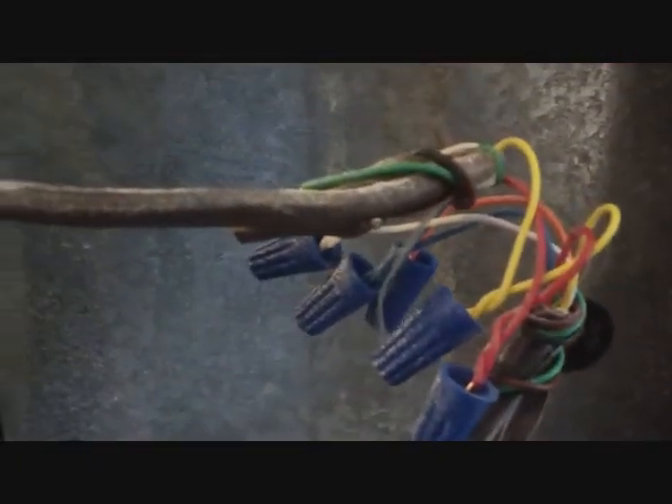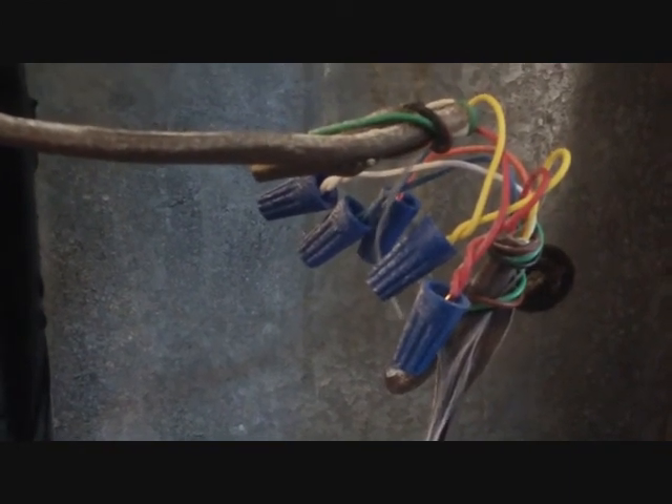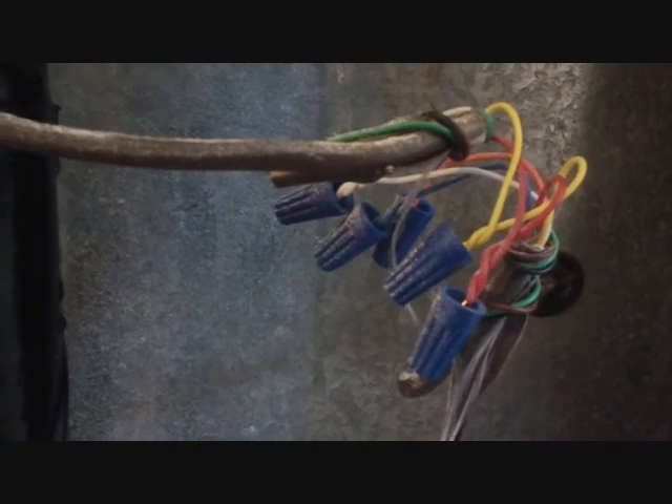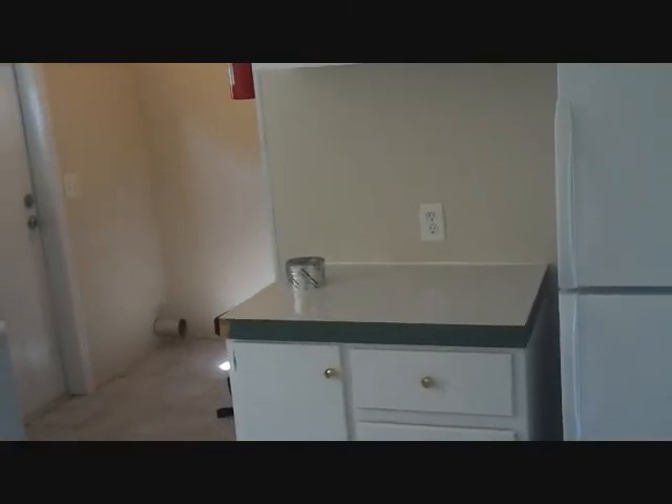It started off on high and now it's on medium-low. I have a strong feeling that in a couple minutes it's going to be on stop. And that is the sound of a very bad blower. So we're going to have to change that out. The furnace is existing but the end coil and the unit are new. She's dead — dead at the door. The perfect end to a perfect day, but we'll be okay.